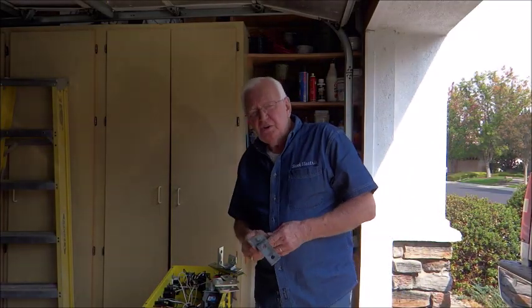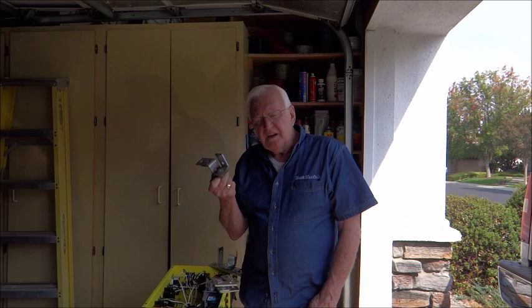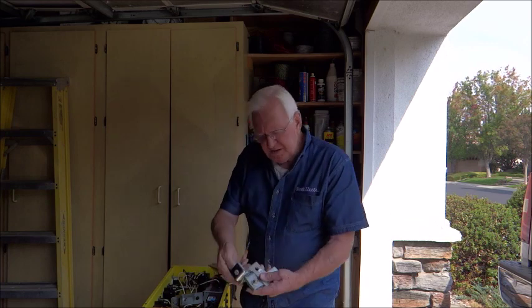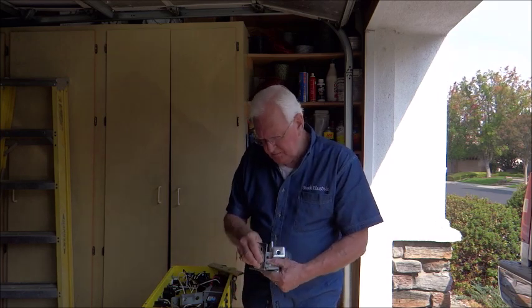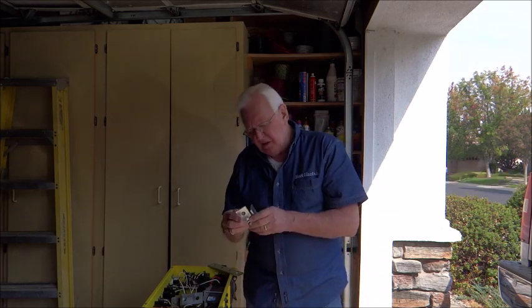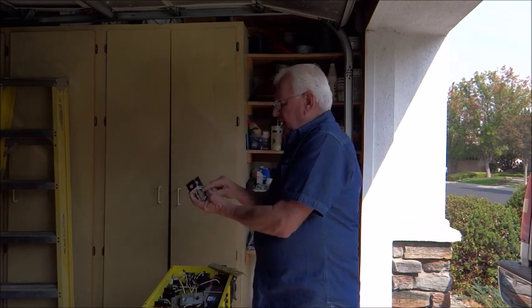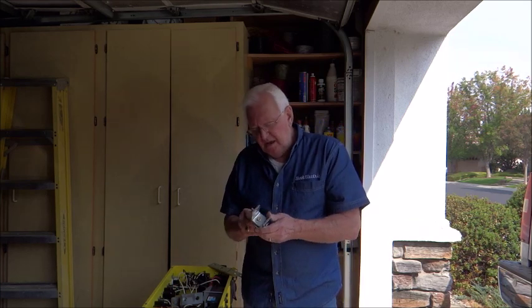That's how to secure your toolbox. Making this is pretty simple — I've got a bunch of Unistrut that I bolt together in different configurations. You can pick this up at Home Depot. Once you get it bolted in the right configuration, sometimes you have to cut off lugs or drill out holes, but then you lock down these grade bolts, mark where you want it welded and where you don't, and take it to a weld shop or weld it yourself.